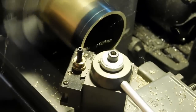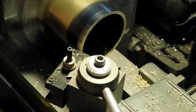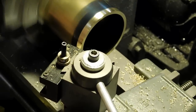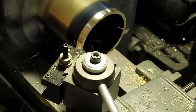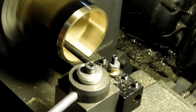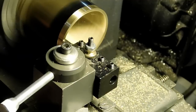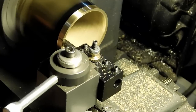I'm facing off this brass barrel right now. I've got it in a four-jaw chuck and the OD was kind of wavy, so I'm just going to put a little bit of a cut in on the OD just to get an idea. I got it in pretty good considering how wavy it was. Now we're using a boring bar - it's kind of small but I took quite a few spring passes just to make sure. This piece of pipe is a little heftier than needed, so a couple extra passes won't bother anything.